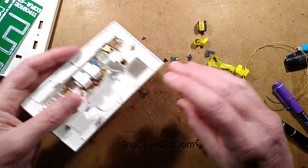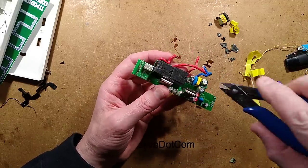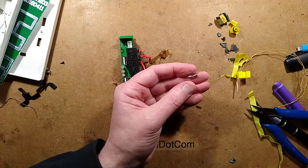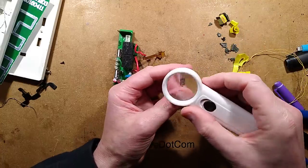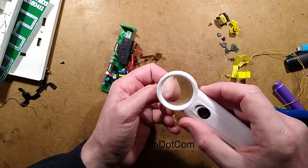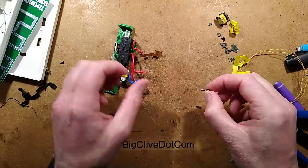I'm wondering what the rating of that fuse is — let me wiggle it until it comes out and take a look with a magnifying glass. It's a glass fuse; if there was a short circuit it wouldn't fare well against a 32-amp circuit breaker. It says — it's rated 16 amps. That's a very small 16-amp fuse — a pinky-sized 16-amp glass fuse, so in the event of it failing it would probably just go black and sooty and properly pop and explode.